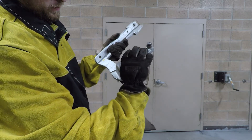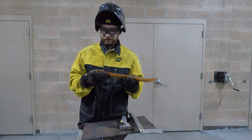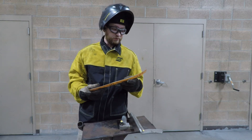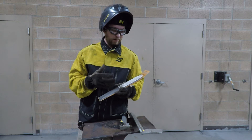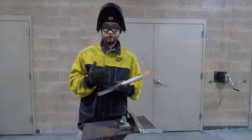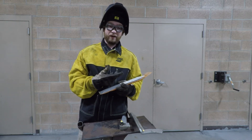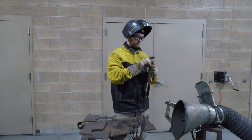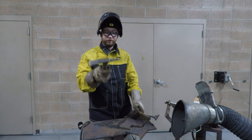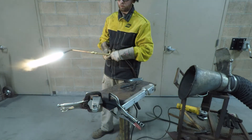I'm going to use this UTP Econocast — it was given to me as extra. If you were to buy this right now, it's pretty expensive, around twenty dollars a pound or more. It's a one-pound pack of Econocast 55. One thing to be aware of is this stuff sometimes contains carcinogens — chromium and nickel — which can cause cancer. We've got a vent hood right next to it. I want to try a couple of test beads on a piece of scrap first. Preheat first, and another tip: when the soot burns off, you're at about 500 degrees.